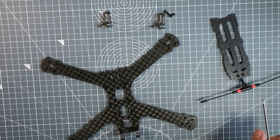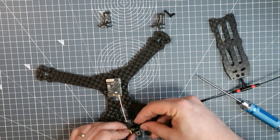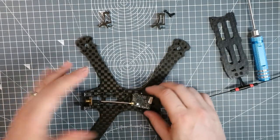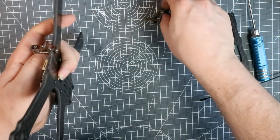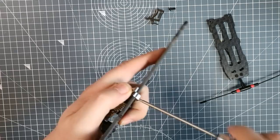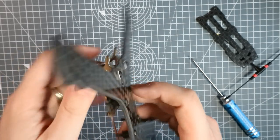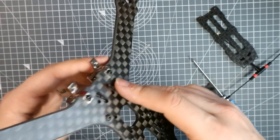Taking some 4mm screws, we're going to place that in the space — there are some little holes in the back. I'll screw the Unifi Pro style one in there. The next thing is to fit these front titanium ends into the little gaps at the front, put the screw through the hole, and tighten that right up. I saw some posts on Facebook about people having issues with the tolerance in this area, but I've got no problems at all — that is perfectly good. There is a tiny little gap at the front, but beyond that those are solidly locked in.